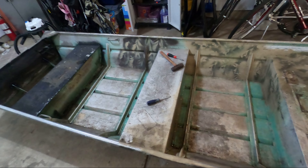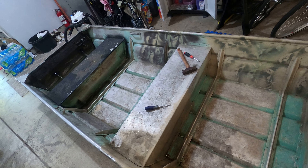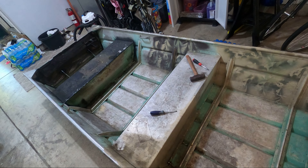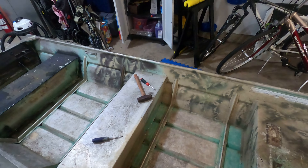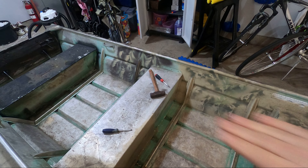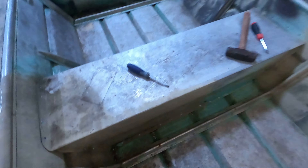Getting about halfway through. Definitely use a screwdriver with the flattest head you can find — that's going to make this much easier. Think about this as if you're just cutting something. Aluminum is so soft it's basically like wood. A wood chisel would probably work best — it would slice these off even easier. You want to get the head of the screwdriver as flush with the surface as possible for a nice clean cut. If you do it right, it'll look like a nice flush cut with no burrs — it just slices right off.